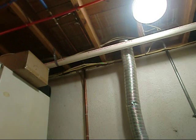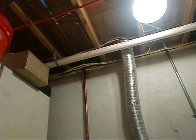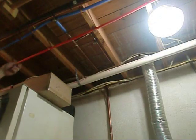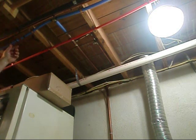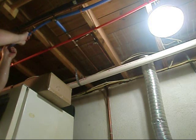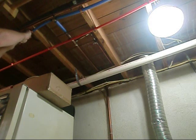Get my tee ready. Slide our rings over our PEX, like so. Slide this ring over it, like so. We can go ahead and put this one in, and go ahead and pop this puppy in. Alright. And it's at our shoulders here.